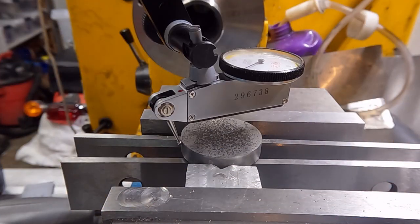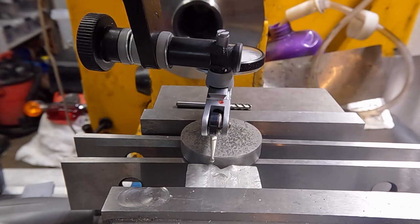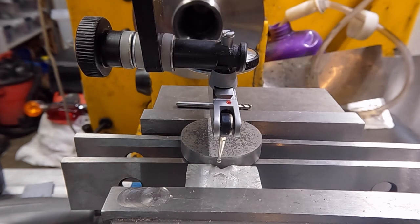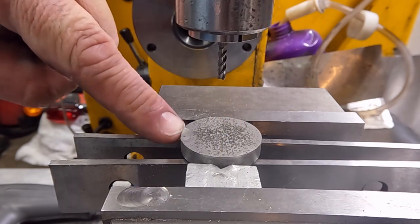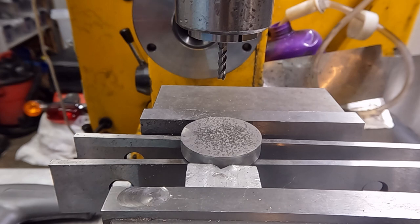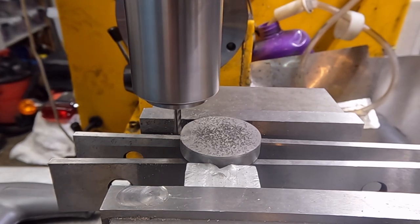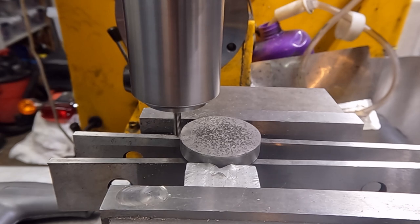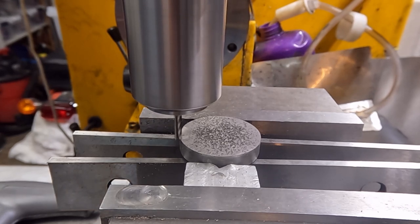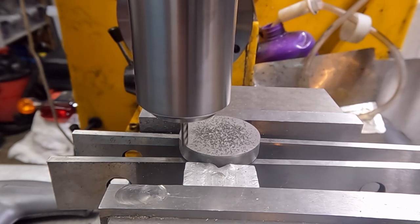To get this centered in the mill I have it mounted fairly high up. I don't have a proper V-block, but this is kind of what I've been using to try and keep circular things. Then I screwed up — yeah, stupidity — I screwed up the initial run of the G-code and managed to run the collet into the part. So I'm taking a very light cut initially just to see where we are. These are G3s, stepping in in a loop — a very short piece of code that will essentially face the part in a circular manner.